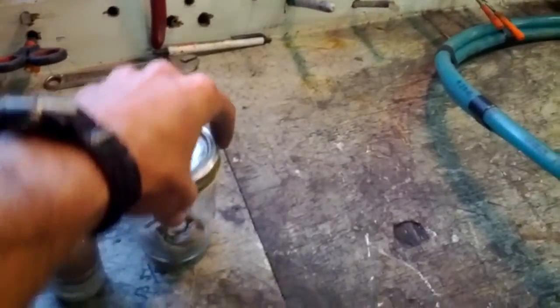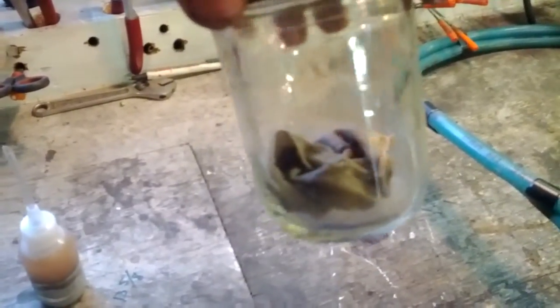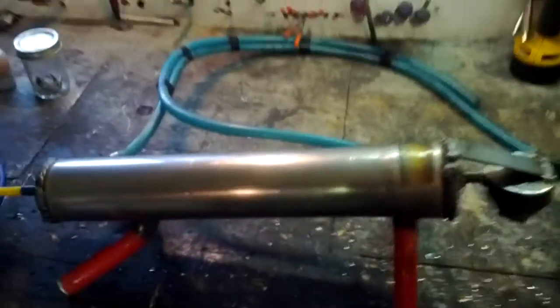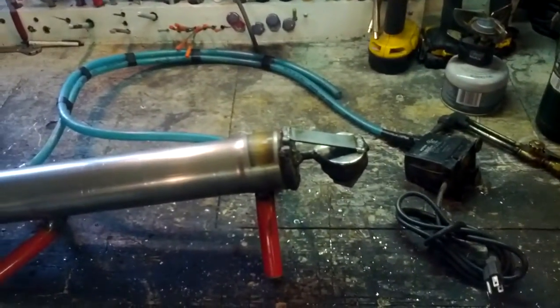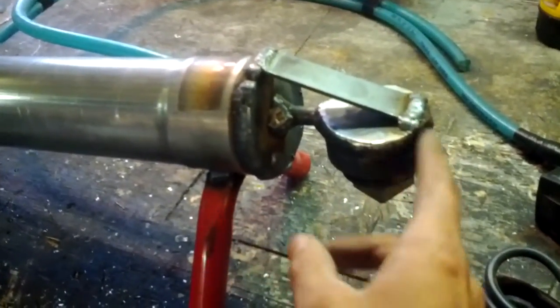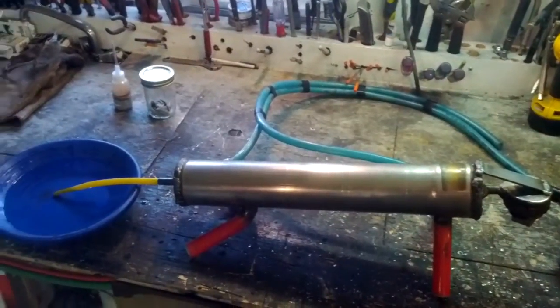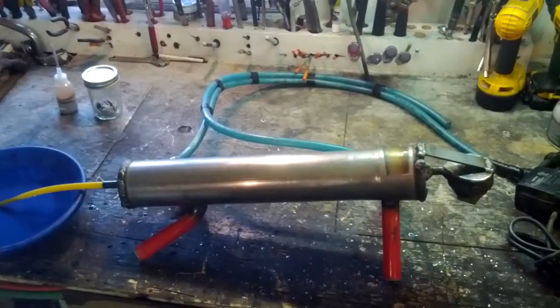Be sure and strain all the extra mercury out with a rag — you need to get a fine rag. This is just a cotton rag and I notice the holes are not small enough; fine particles of gold will go through this. Get all the mercury out of your amalgam before you retort it. Make sure you do this outside, just to be safe, and pressure check everything. I've got a little bit of a leak here — if I can't fix that in these threads, I'm gonna change this whole end piece to a union fitting. But anyway guys, if you want to work with mercury, there's a retort so you can recapture your mercury and stay safe.